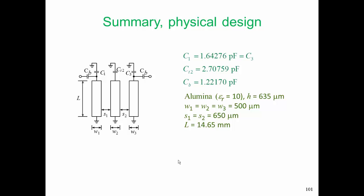In summary, here's our physical design. We did not change these capacitors. These are the physical parameters of the three coupled microstrip lines. C1 and C3 mostly form part of the resonator with the first and the third microstrip line, but part of that capacitance comes from the matching network. CT2 is the capacitance to complete the resonator in the middle, and CB is part of our matching network.